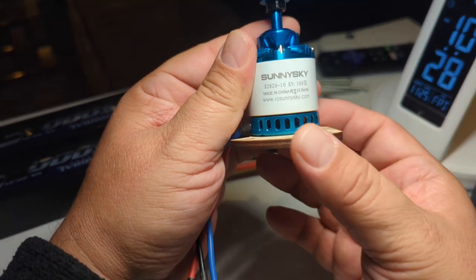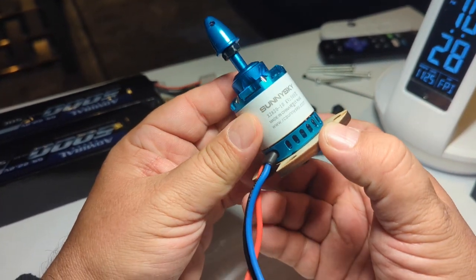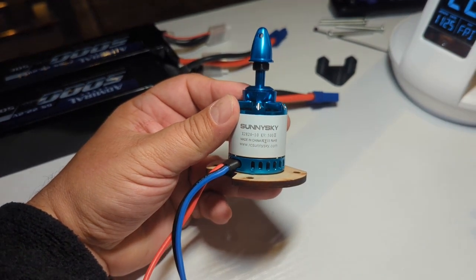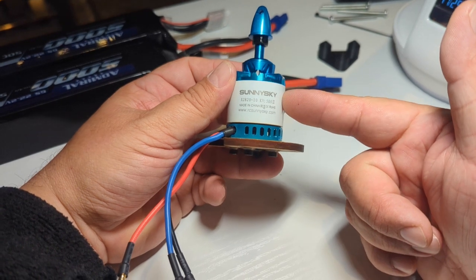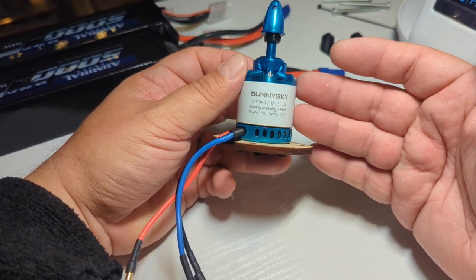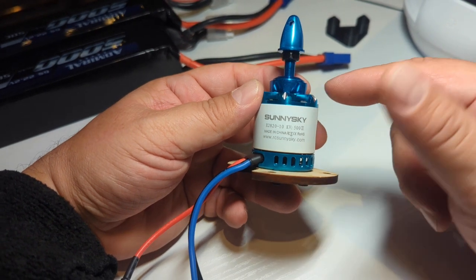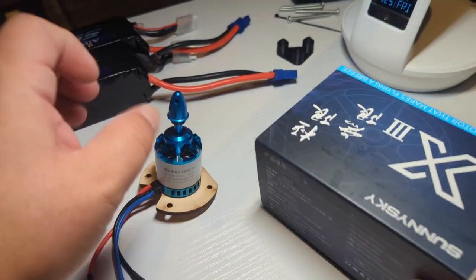This is what I was saying — it just doesn't seem to be the right size motor for this configuration. It overheats if you keep throttle high. If you buy it from ReadyMade RC, I would recommend trying to get them to upgrade the motor, otherwise you're likely to face this. If you already have this motor, be careful going full throttle — I don't think you can go more than half to three-quarters throttle. Set that as your maximum using a throttle cap, or on an autopilot like ArduPilot you can set a maximum power limit.